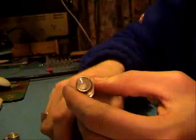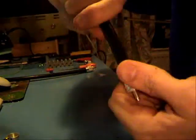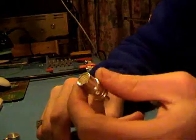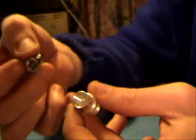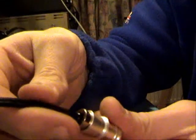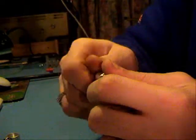This one is actually the 9mm version which is designed for the RG213 or similar, and it should just pop in there — nice tight fit, like that. It's got little screw threads which help grip when you pull it down. You can also get the 6mm version of these, but I haven't got any right now, so I've got the reducer which takes it down from 9mm to 6mm. That just screws in there and that's good enough for your other cable. Then you just solder the braid in there and solder the inner there and you're away.